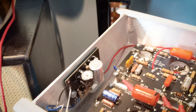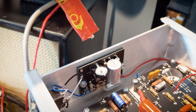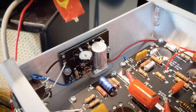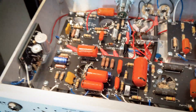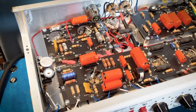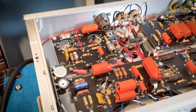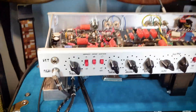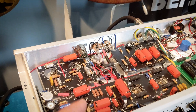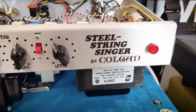It turns out there's not enough current draw for it to be a real problem. Yes, there are different voltages, and this FET is dropping a bit more voltage, but the amperage draw is still very low — it didn't drop a single volt on V1. I'm confident that even though the resistor is 150k versus 220k, there are no concerns about any byproduct affecting V1's tone. V1 voltage relative to the rest of the amp is very important for tone, and it appears to be unaffected.